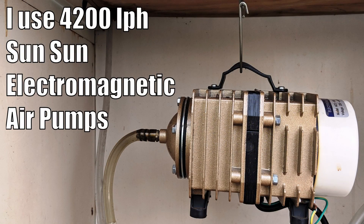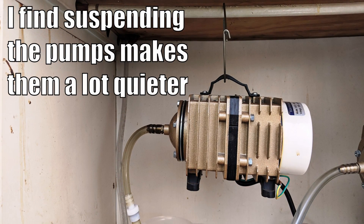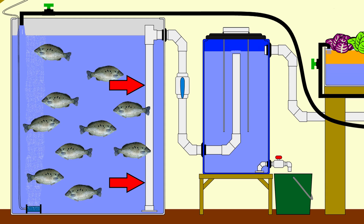For this system I'd suggest a 4500 litre per hour air compressor, which will supply enough air to the fish tank and also look after a few other needs in the rest of the system. Now back to the water in the fish tank — as water enters, it displaces the water already there up through the base of the solids lifting outlet. The solids lifting outlet is a two inch or 50 millimeter pipe running from the base of the tank, collecting fallen fish waste and uneaten fish food, delivering it up to a sideways-sitting T fitting at the top.